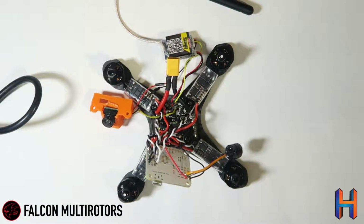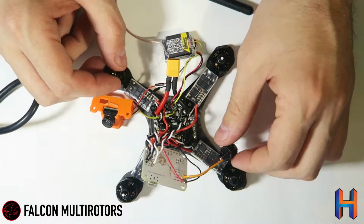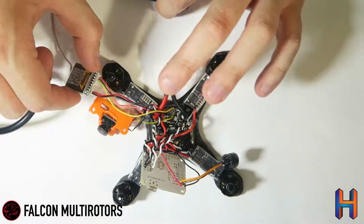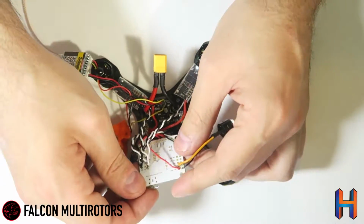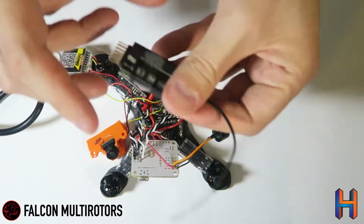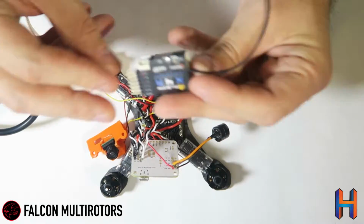There we go, so they're obviously out of sync. We need to fix that when we get to the software configuration, but that's good. All 4 ESCs did arm and do their post sequence, so that's a good sign. So the next step is going to be wiring up our X4R. So we'll go ahead and depin this and get that wired up in the next video.